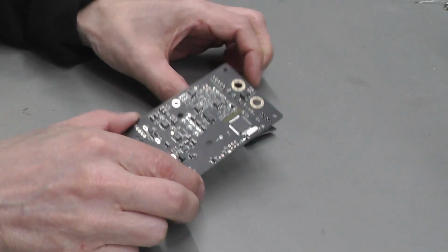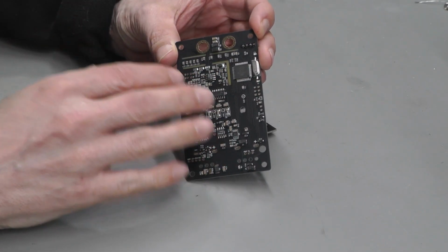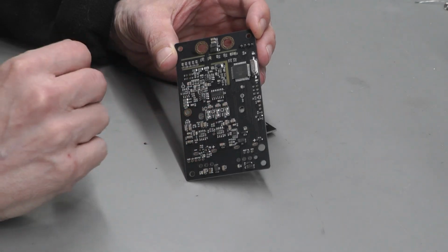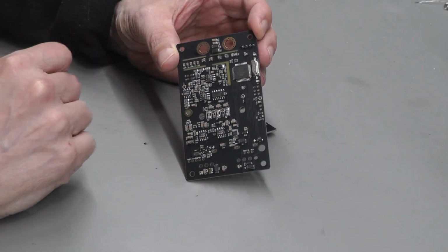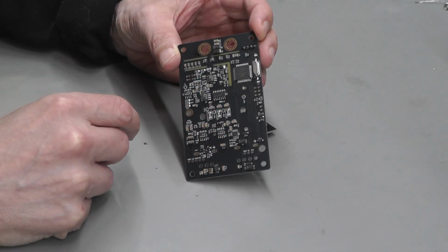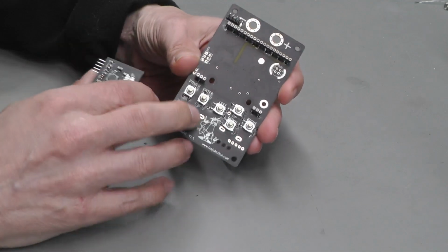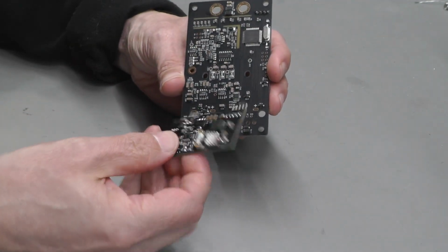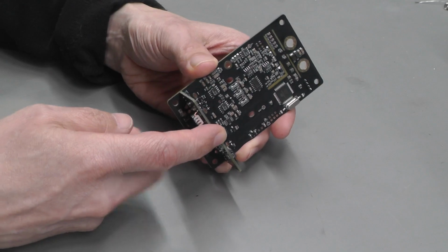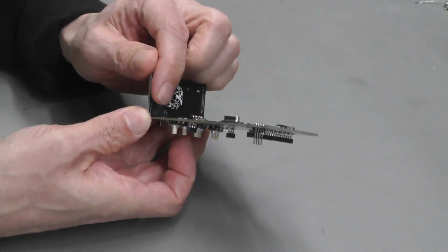So what I actually do is just give this board a good visual check. The soldering, as I showed in the last video, is usually pretty good from the reflow oven, so there's not that many shorts or anything like that I would normally find. The main problem might be, as with the charger board, maybe I've forgotten to fit a component or something like that. So after giving the main board a good visual check, I solder up the charger board to the main board like that, and then I can power up the whole unit via the DC socket here, which lives on the charger board.